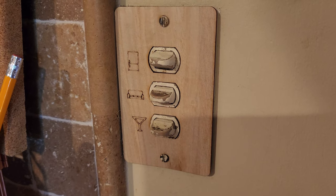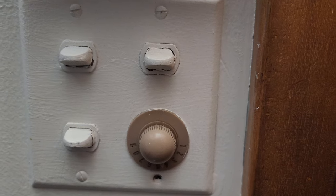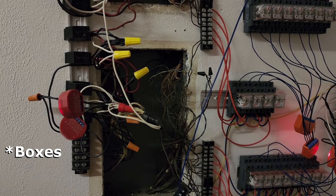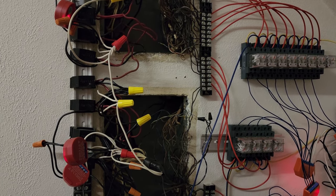Back to my system. In every room except the laundry room, a small storage room in the shop, and the game room, which was added 30 years after the house was built, I have these switches in various configurations. In the master bedroom, I have this dial, which I'll explain in a moment. I have a total of 52 individual switches that all run to this box where the old latching solenoid relays used to live. This is a big mess, but there's a few good reasons I'll discuss shortly.